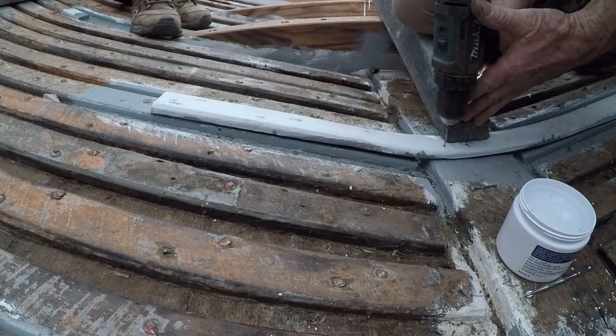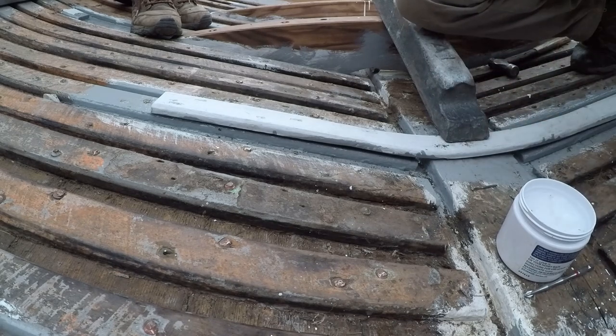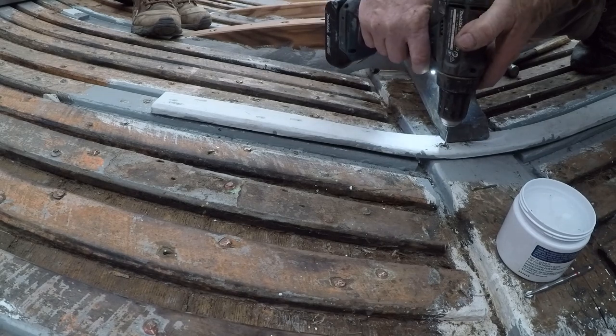You know, we rarely use twist drills. Oh yeah. In the old days, umbrellas used to have spring steel in the spokes, and if you could get an old umbrella, it was about 1.6 to 2.5 millimeter spring steel. Okay. And you would just cut off 4 inches of it. Yep. Hammer it flat. Put a sharp edge on the front. And it disappears. Right. And the smaller ones are the smaller ones. Yeah. And most of the nail drilling is done with a pierce. Okay. I think I've still got some in my box.